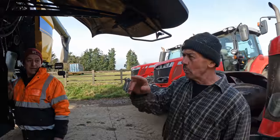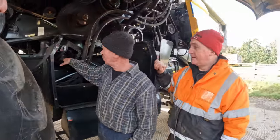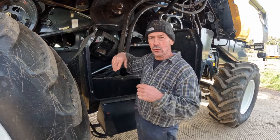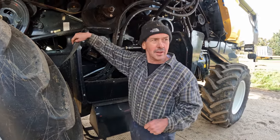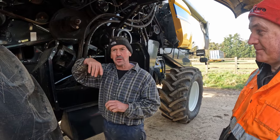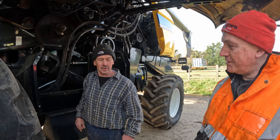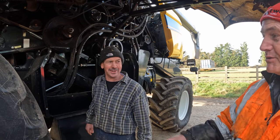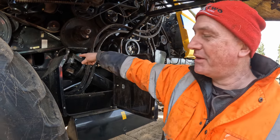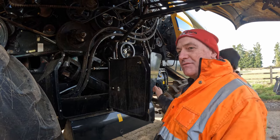Just a little difference on a Massey - on the old Massey that used to come out and drop on one side of the sieves, overloading the sieves on one side - it was bloody rubbish. This thing throws it straight across. It's got one either side. This one throws it across halfway and the one the other side throws it back from the other side halfway, so you're spreading it across your sieve bed.